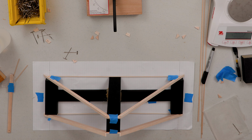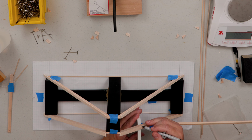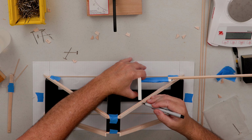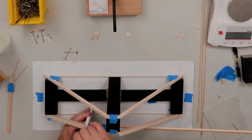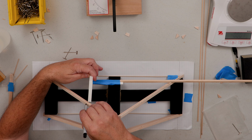Okay. Oh, I forgot to make, see, this is what I do when I do it live. So usually I like to make the mark on the legs at 12.5 centimeters. I forgot to do that, so I'm not going to pull this off the jig. I'm just going to wing it here with this block. As long as you're not too short, give yourself a little extra space. You probably want at least a millimeter or so extra. I guess this is a reasonable way to do it, but if you mark it ahead of time, it works also.